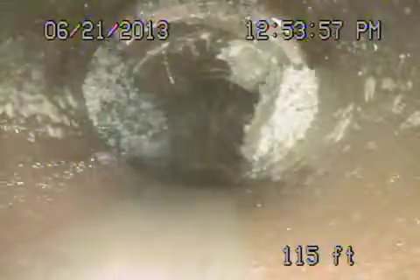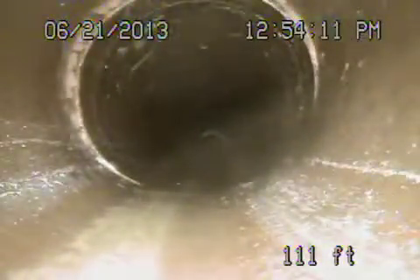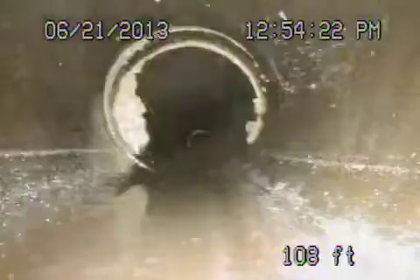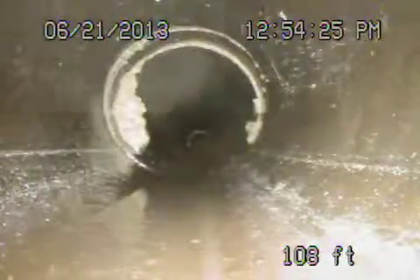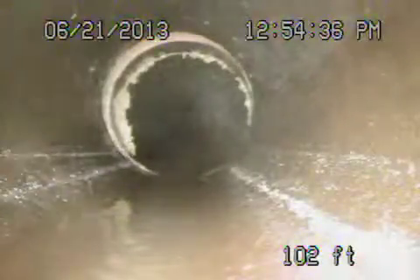We have a shift here at the coupling — and right here, that line is a crack in the pipe. It's a little difficult to see, but it's a crack break. Still 4-inch clay pipe. Now there's another coupling, and another crack — you can see it's all the way around. Another coupling, another crack across the yard at approximately 6 feet deep. Still 4-inch clay — entering the driveway now. Same thing here: coupling and a crack. That's basically every single joint looking like that.